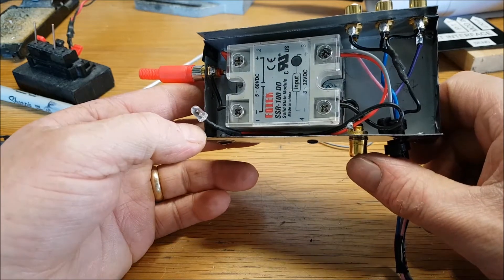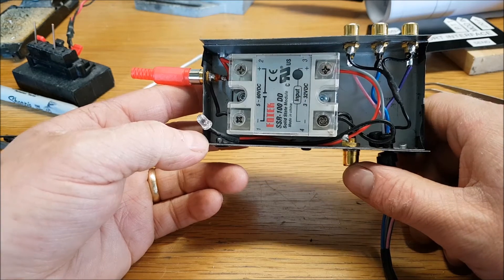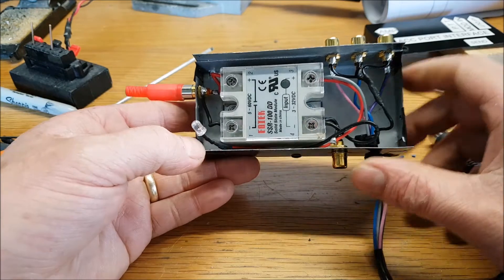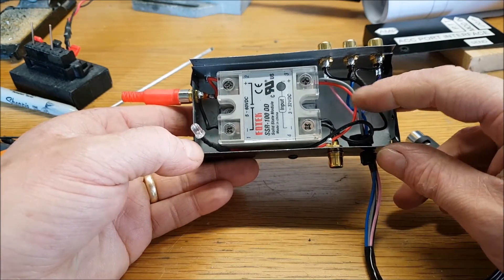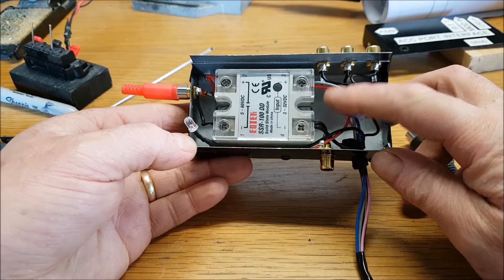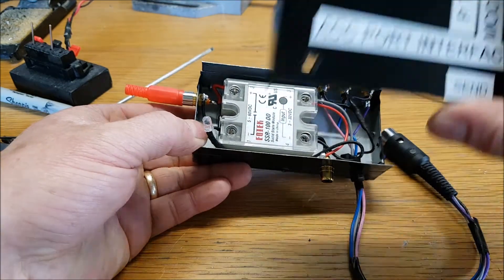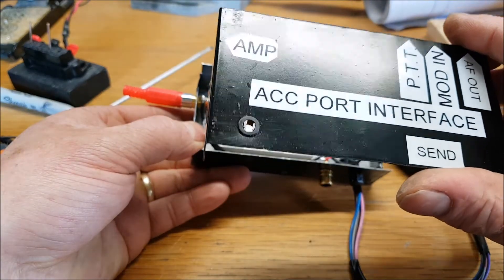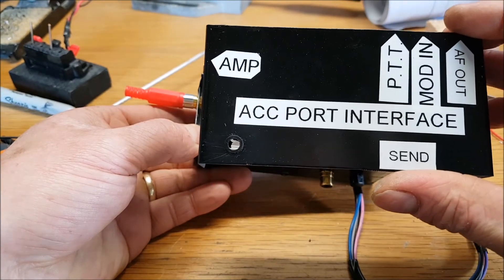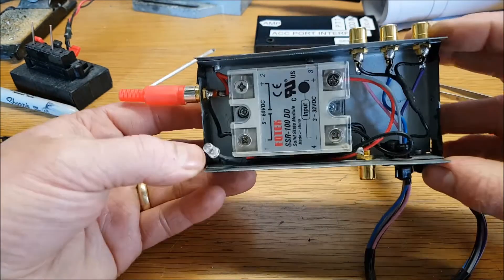You can see there the input: just one single wire from the center pin goes to the minus terminal on the relay. The other two wires — the gray wire is the 13.8 volts from the radio to the relay, then the red and black wires are there for the LED, which I put a little bezel for in the lid so it sticks up out of the top. Crudely labeled but it'll do the job.